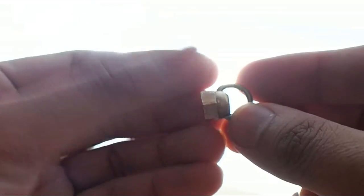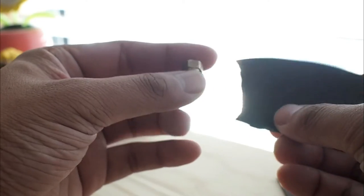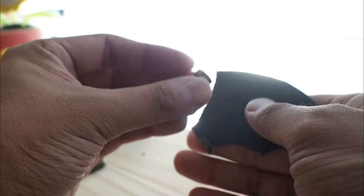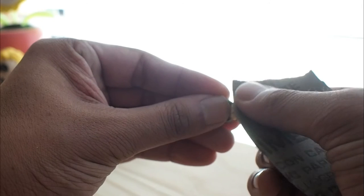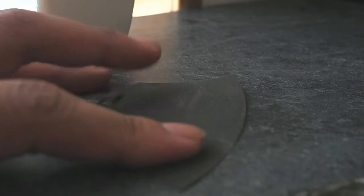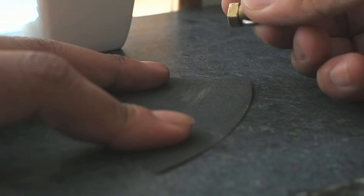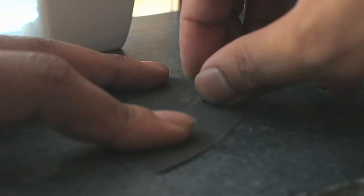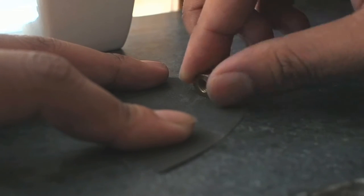It's easier to take those parts off with sandpaper because of the large surface area, so just take sandpaper and smooth it out by hand, removing the roughness left by the file. You want to use sandpaper that's around 300 grit, and if you want it extra smooth, continue with a much finer grit. You can also do the whole process with just sandpaper — put it on a hard surface, take your nut, and start sanding, taking out the edges and smoothing out those flat surfaces.